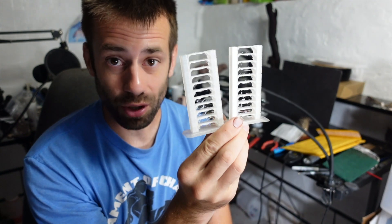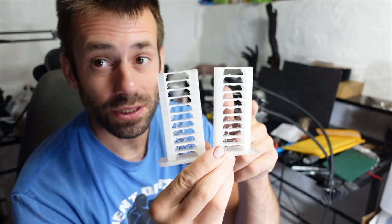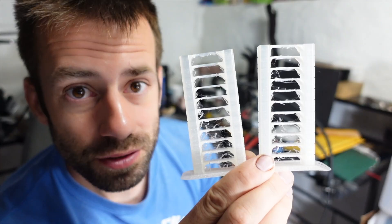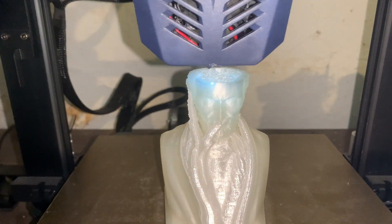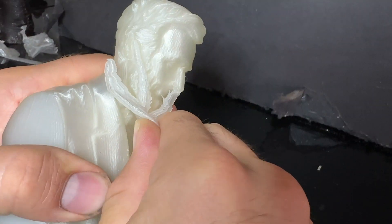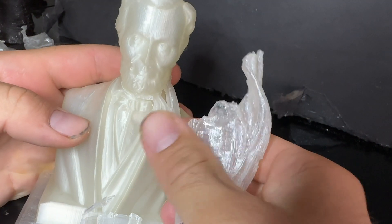After a few test towers, I realized this filament is more finicky than PLA. But it looks like about 205 degrees gives the best results for temperature — still not super great, but we're gonna go with that. I'd describe this filament as being maybe a little more sticky than PLA. And while I'm no 3D printing master, I did get the settings dialed in good enough to get started.